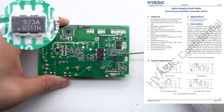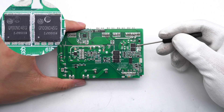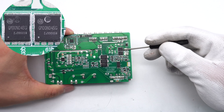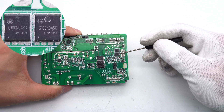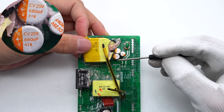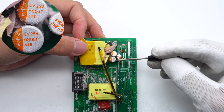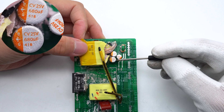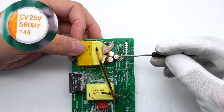The synchronous rectifier controller's high current driving capability makes it suitable for a variety of synchronous rectifiers. The synchronous rectifiers are from HR-micro in a PDFN 5×6 package, two used in parallel, rated 100V/4.2mΩ. The solid capacitors for output filtering are from CanCap: two are 25V/680μF and one is 25V/560μF.